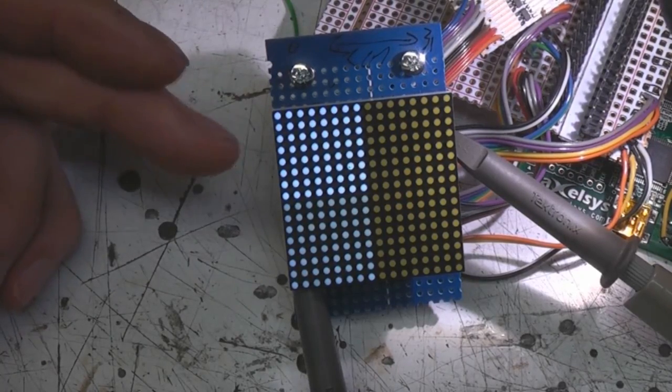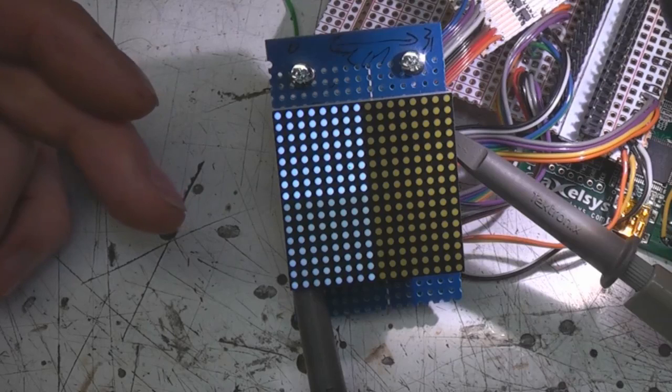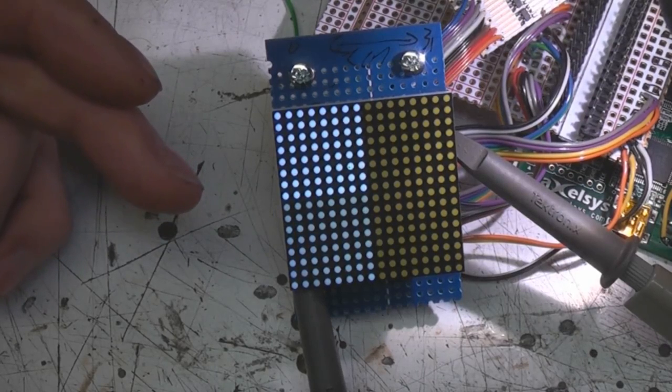The efficiency of these LEDs isn't particularly great. I think with LEDs that give better brightness at lower current, they might be a lot more viable to drive without even the row drivers. But for the sake of some little dual MOSFETs, I think it makes quite a big difference, and obviously puts quite a bit less stress on the FPGA.